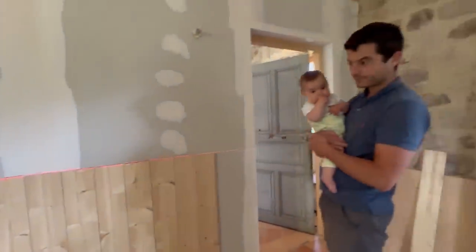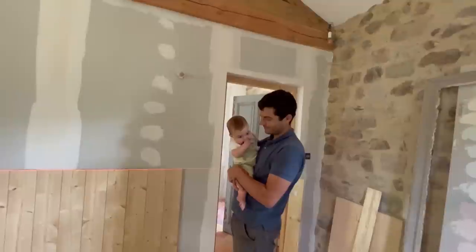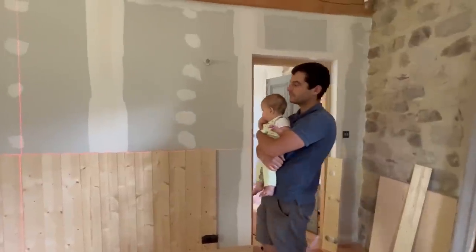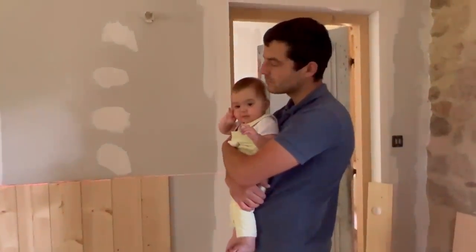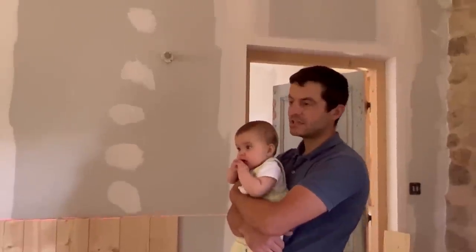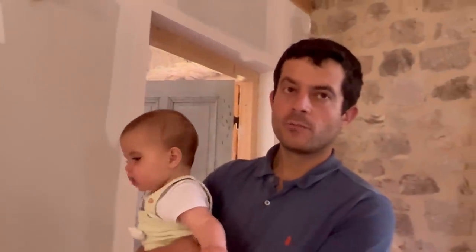Yep. And a few people, like Mike from the channel Meanwhile in Indiana, if you have a look at that, he suggested that we stained this woodwork rather than painting it. And what's your response to that? I think the wood's not quite nice enough to be stained. It was quite fashionable to stain it in, but I just fear it might look a bit too 70s if we stained it. It's partly because it's very, very uniform, isn't it? It's clearly industrially made. And traditionally they would stain more noble woods, but pine would just be painted and covered.